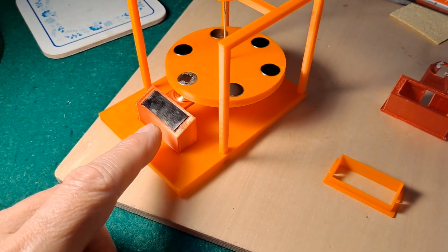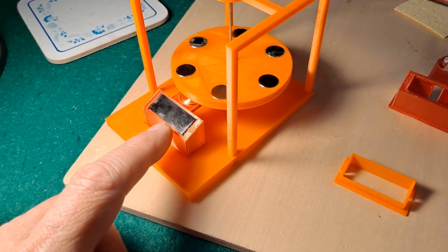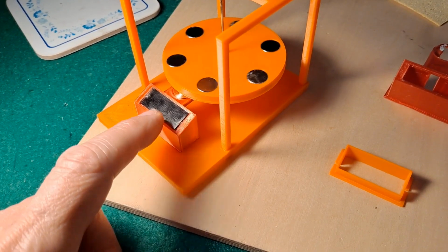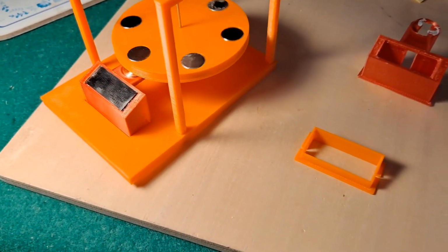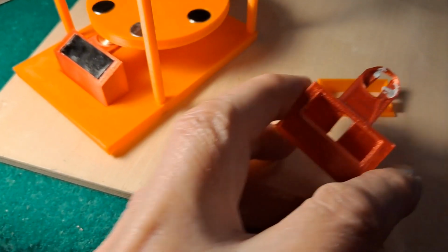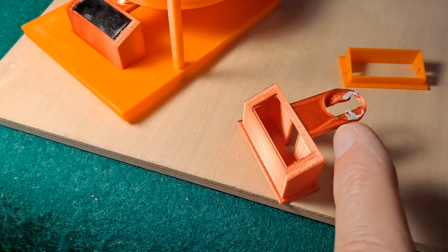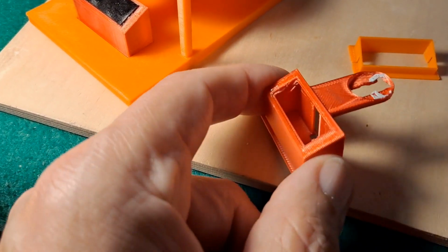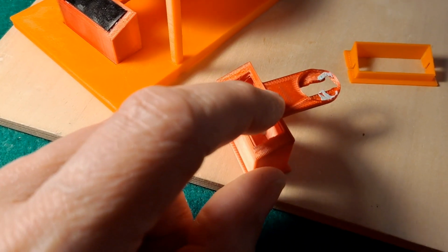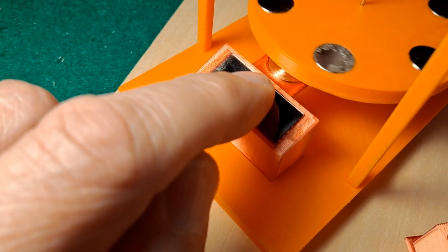I decided to make myself my own little design holder for the solar rocker components. So we've got the panel there, the electrics are inside that little box, and you can just see the coil there. So that was what the original design was. And then that's what I've done, although that one I'd made a bit too far in. In fact, it'd be a good idea if I could make that adjustable. But see, I've got about 10 millimeters there gap from the top to where the coil goes, whereas there it's down to just about 2 millimeters.